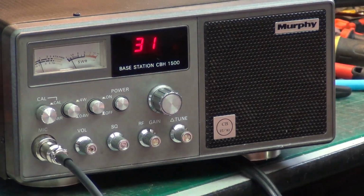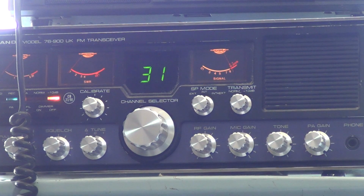So we'll go over to our base station, see what this sounds like on our standard replacement mic into our Midland 76900 base station. Tango 21 testing the Murphy CBH1500 base station into our Midland 76900. So we're looking for hum, which these do suffer from. So the customer's changed the power supplies and power supply capacitors as well as others, and it looks like it's eliminated it. So we'll go over to low power. That will clinch it, because now on low power doing 210 milliwatts there won't be a hum. Back to full power and there will be a hum if there's going to be. So there you are, Murphy CBH1500, probably the best one I've seen. Thanks for watching.